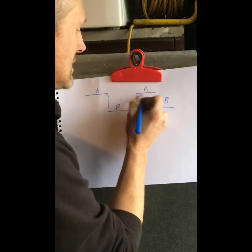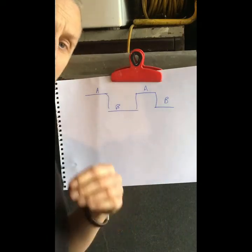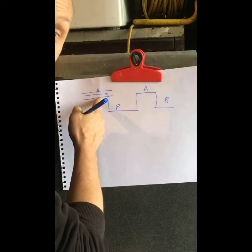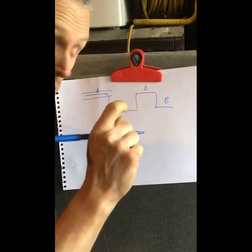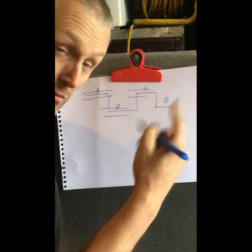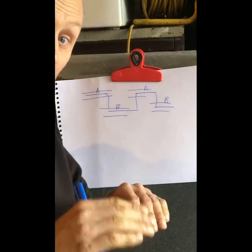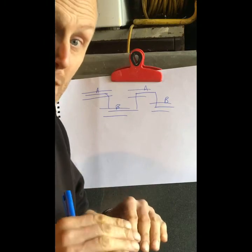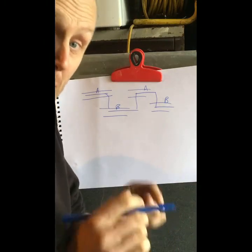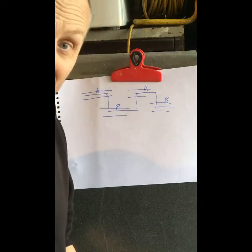So our frequency will do this, a bit like a square wave or a sine wave. And what our receiver will be looking for is this frequency A within its limits, within its threshold. Again, frequency B within its threshold, frequency A within its threshold, and so on. And this is happening that quickly that what you're getting is a whistling noise. So that whistling noise you hear, that warbling whistling noise, is a combination of the two frequencies happening. And you can hear that landside. It's actually in the notes to listen out for the whistling frequency.